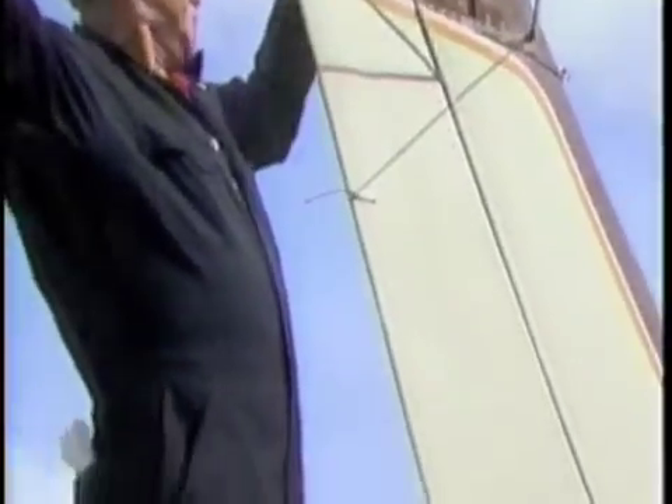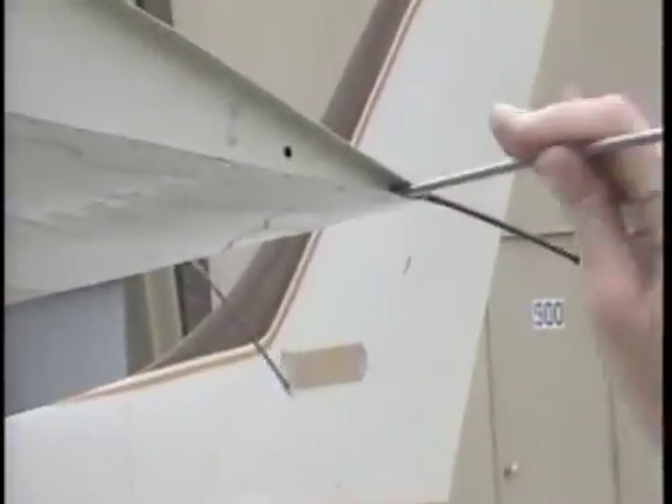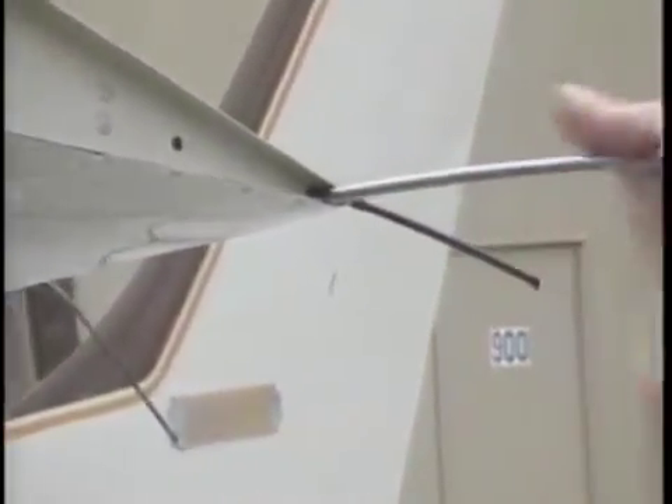In most cases, you'll find additional access through inspection ports. All areas of the aircraft should be treated because all areas — such as flaps, rudders, ailerons, and stabilizers — are places where corrosion will occur, so thoroughness counts. The challenge here is a test of your ingenuity to find the best access to the internal structure of the aircraft. You'll also need to determine if too much fogging or material is being used. The rule of thumb is to look for excessive material coming through lap joints. If this happens, less time fogging in the structure should be performed.